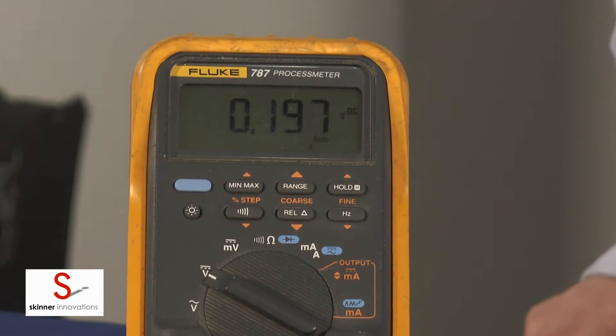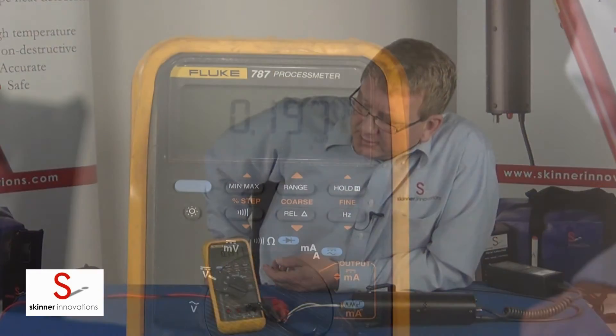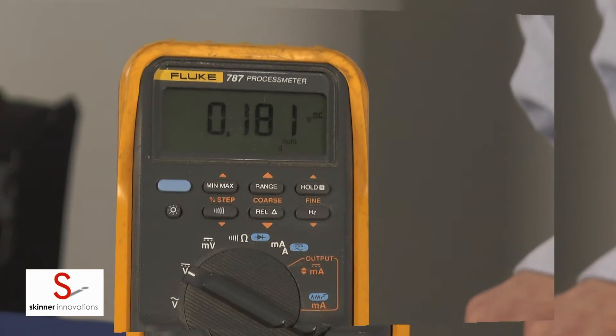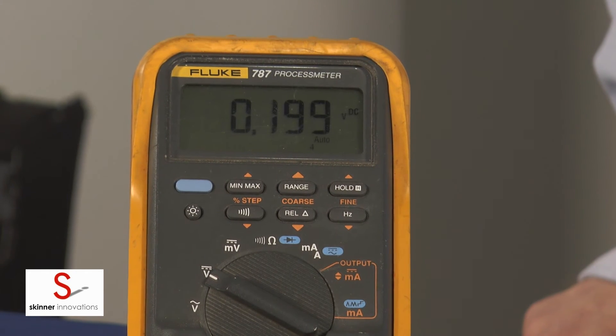Okay, we got a second trip at about 193 degrees Fahrenheit. After just a couple seconds it will turn back off again and the cycle will repeat. Temperature will drop and we'll see an auto reset soon — there's the auto reset. Okay, the temperature is rising again. This trip was at 193 degrees.